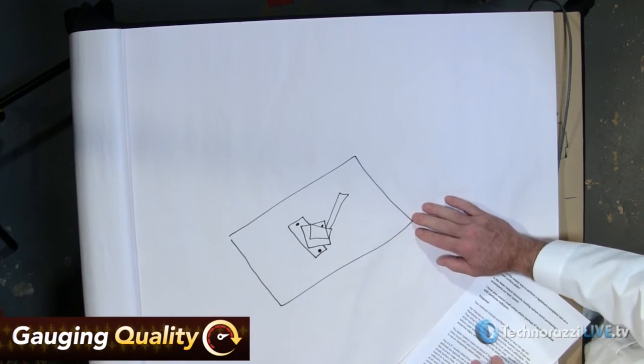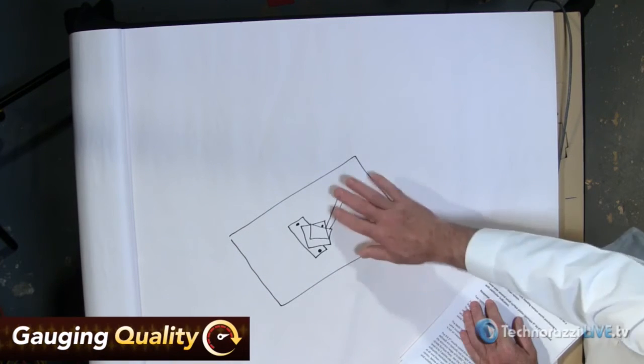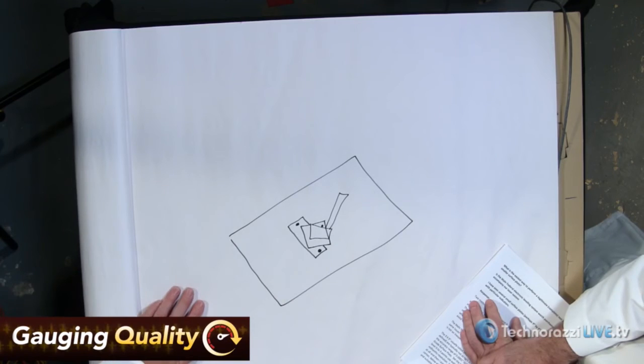Oh, okay. The only tolerance you are going to be dealing with is the lab grade plate and the tolerance of your indicator. And the indicator itself. Okay. So it's pretty insignificant when you're dealing with 0.5. Yeah, the surface plate. You're resolving to 5/millionths. It's pretty insignificant. That would be an appropriate method to check the smaller ones.